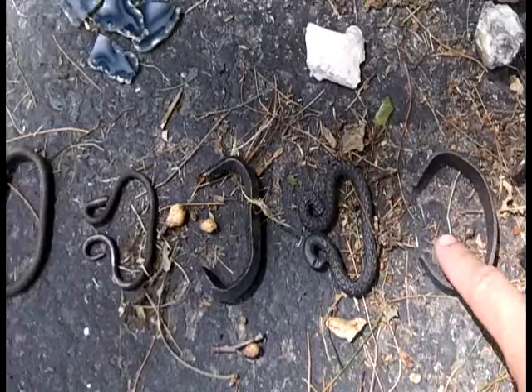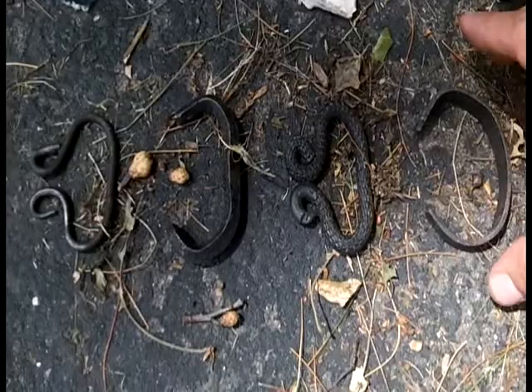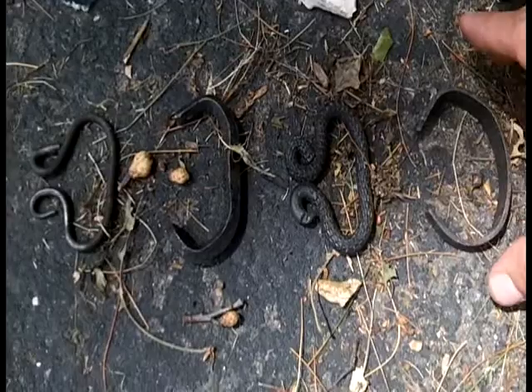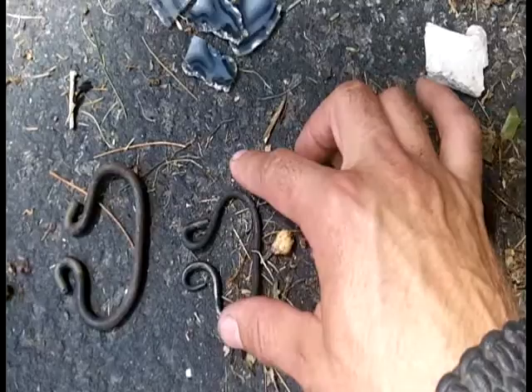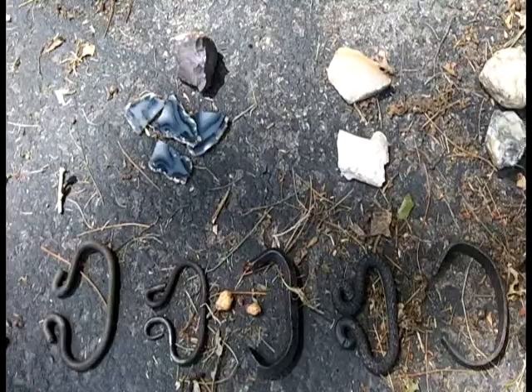Take a look at these — these are all different fire steels, fire strikers that I forged. I do a little blacksmithing. They're all basically C-shaped. These two you can actually wear as a bracelet, which is kind of neat. They're made from high carbon steel. The best place to find high carbon steel that I know of is wood files — just a file to file wood. You can get them at a hardware store, or where I find them usually super cheap at yard sales, 50 cents to a dollar or cheaper.